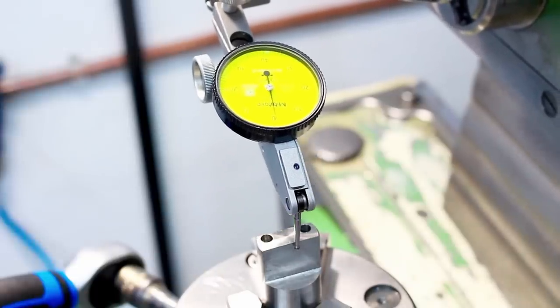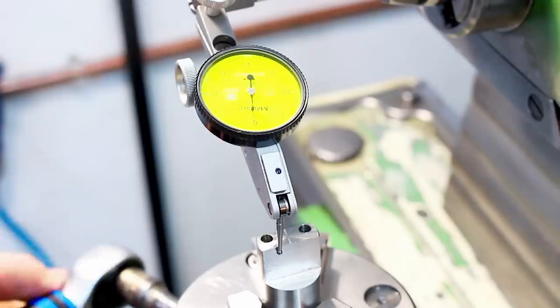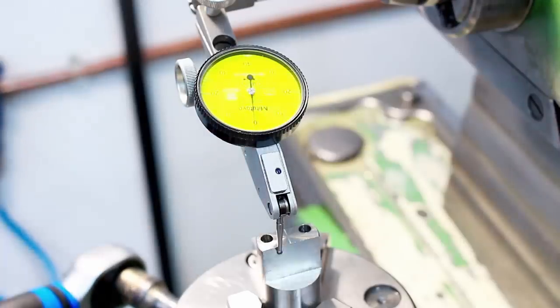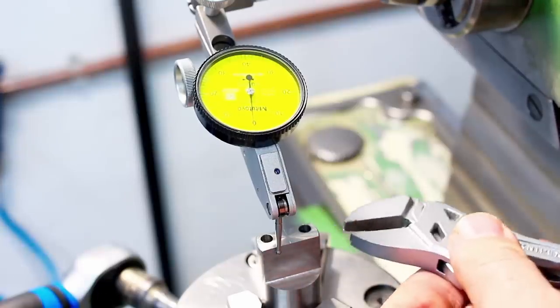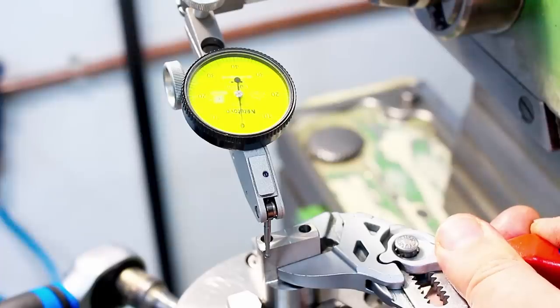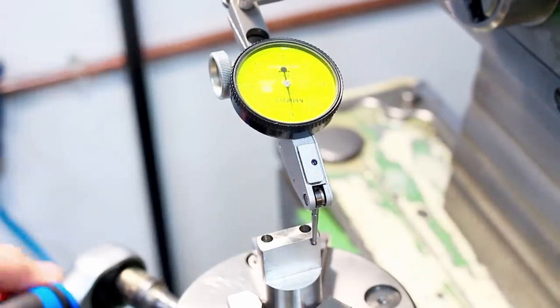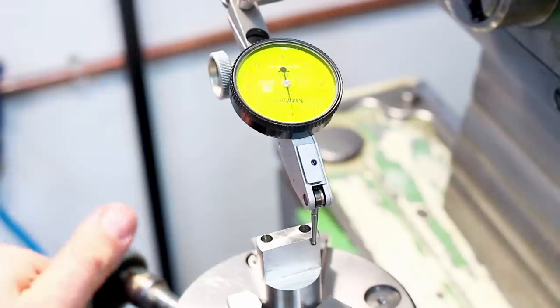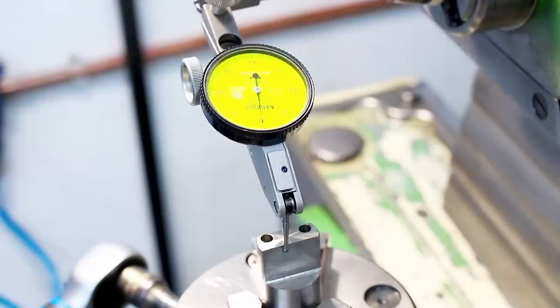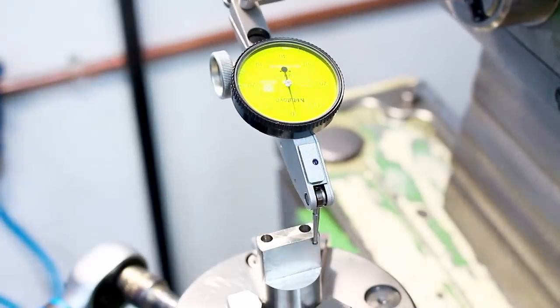And it moved a tiny bit. So we go back, we loosen it a tiny bit. Well, a good amount, so we can still move it. Okay, now we crunk back down, and it moves again. So minus one, yeah, that's still within 10 to 20 microns. Perfectly okay for this part.